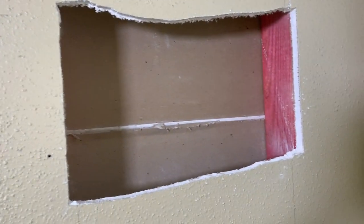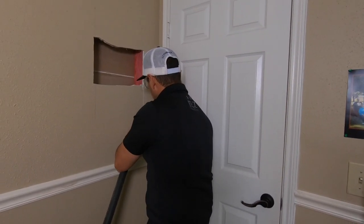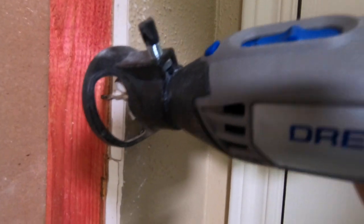So we cut this piece out. Now we're just going to take a little peek and see what's in there. There's a wire right there. Clear above. So I've got to find out how far that wire is — it probably follows all along there like that. That rides right along that stud. Sometimes though, if you keep the bit there too long it starts to burn the wood and dig in a little deeper. Take your time, but don't take your time.